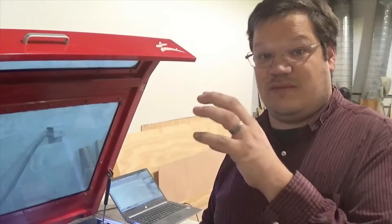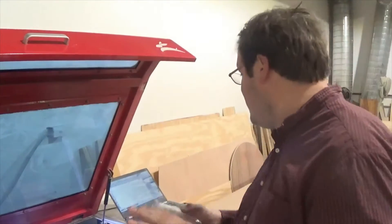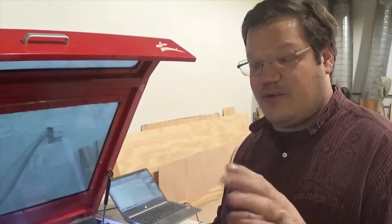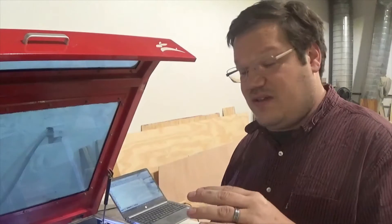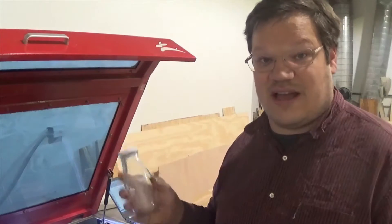I'm going to change the image outline to blue. The settings I'm going to use for engraving this glass bottle are 45% power on an 80-watt tube at 375 millimeters a second. If you have a 60 or 40-watt laser, just slow it down to compensate — you could potentially engrave this on a 30-watt laser. If you want to switch to a diode, you can mark glass with certain paints and additives.